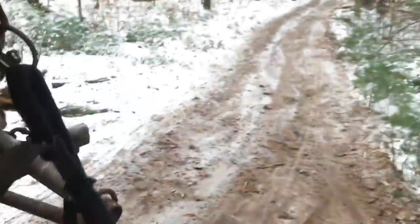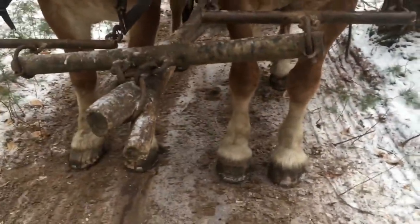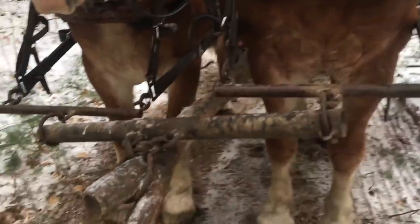So I come up here and go grab Lady's hoof and see if you can see what I'm talking about. Come here, Lady. You'll see that there is nothing on that toe cork. Nothing. And the heel cork is nothing. So tomorrow we'll put a bead of Drill-Tex on those shoes, on the corks, and that will make a big difference.